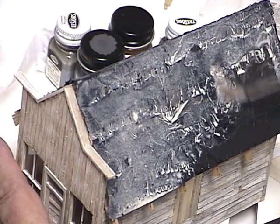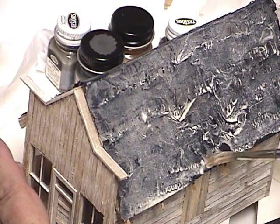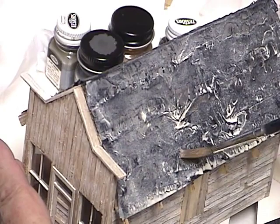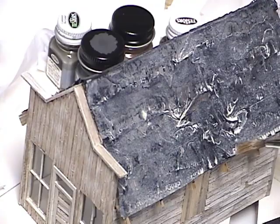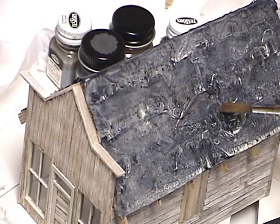And I'm just continuing to show you this so that you can really see how thick the paint is. You can tell by the way I brush it on just how thick it is. You come across the bottom, it flows along to that bottom edge. See there on the left how that white is building up along that bottom edge? We don't want it to do that. We want to pick that up from there. And then once we get it to the way we want, we let it dry and soak it out of our brush like that, and then we can come right back and lift up some of that liquid that's right along the bottom. Any place where it's really pooled up bad, you may want to just soak it up with a dry brush, just like I'm doing there.